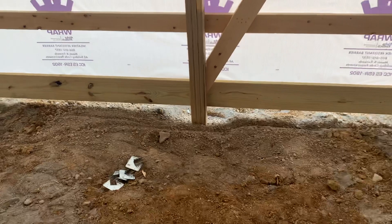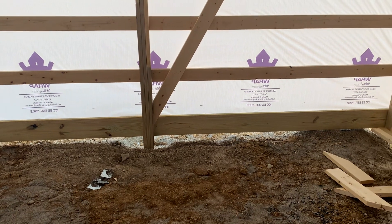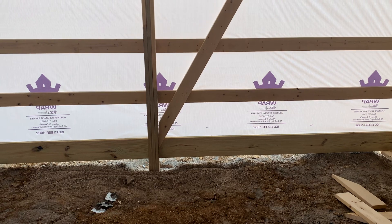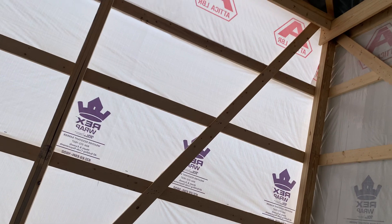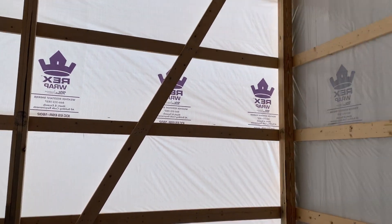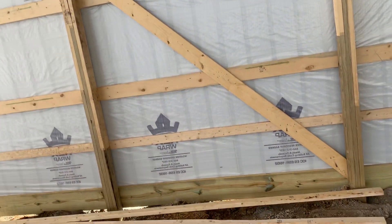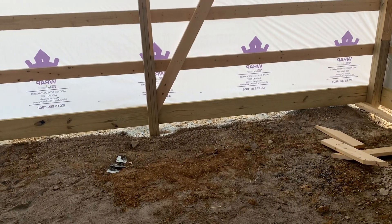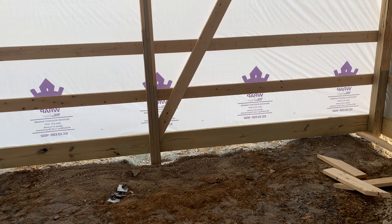You don't want to have post rot. There are always options to do a concrete wet set or concrete permacolumns, and we do all those applications as well. But this customer chose 3-ply for budget, application, and usage. We also have diagonal bracing running at 45 degrees, and running 2x6s as well. For more information, visit attickalumber.com. If you follow the journey, like the video and give it a thumbs up.